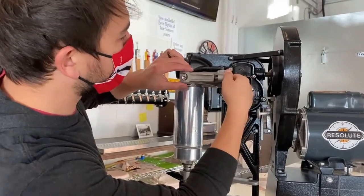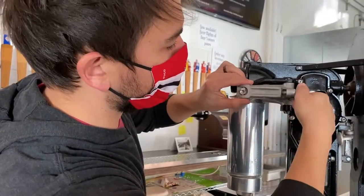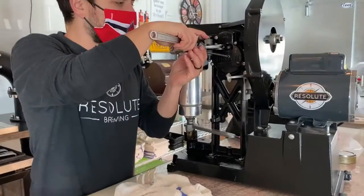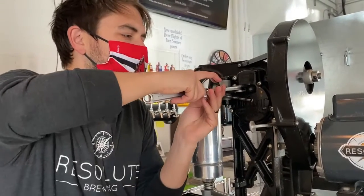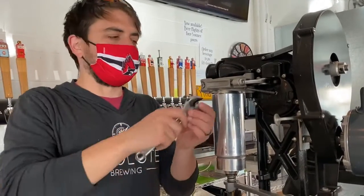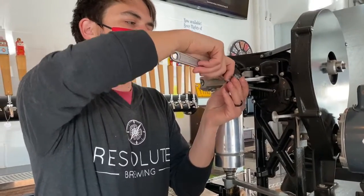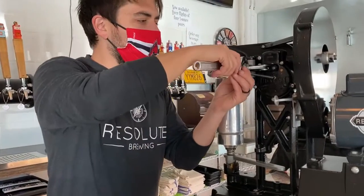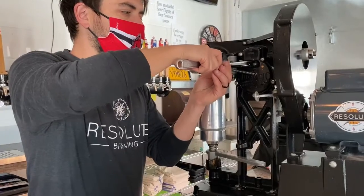Everything goes wrong. So that means this arm is in too far, and you can adjust it with these screws. Do you have a screwdriver or a wrench by chance? What I'm doing is not really the scientific way to fix this. We have a micrometer at the brewery, and you can measure the distance it moves. Also, really good troubleshooting videos are on Oscar Blue's website. Just look up the Crowler machine, and they have all the models and all the issues that people come across. I can also help. Just give me a little heads up, and I'll stop by.